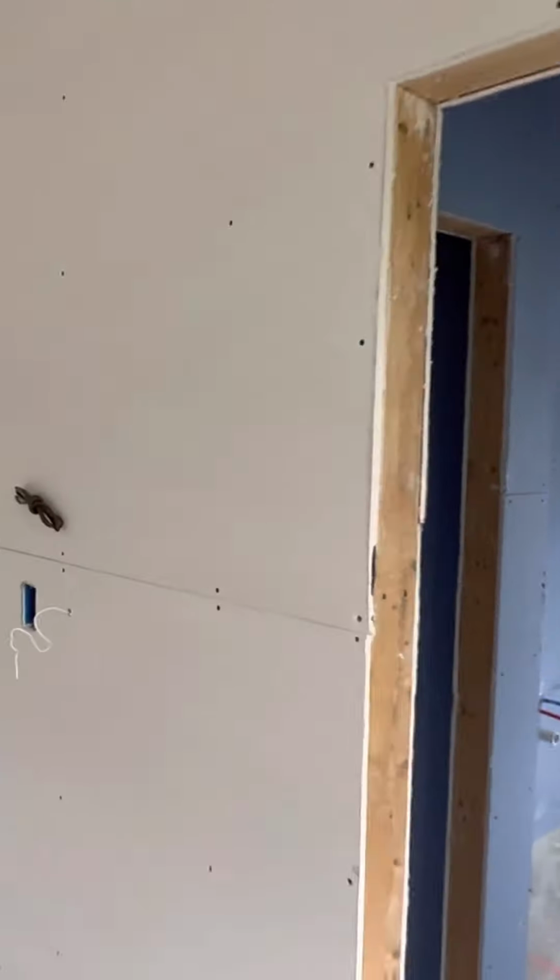I try to make the drywall square in the corners. You see there's some big gaps up there. There's still a gap I have to fill here, but I need a little bit of scaffold for this room. That was a big gap right there. The hangers used a router to put the flat together. You can see some breaks over here. There's a big break over here. There was another big break up there on that flat that I had to fill. Another one here. Now these are all pre-filled, so when I lay my tape on there with my Bazooka and I go across my angles with my glazer, everything's gonna come out flat and smooth. So that's the first step that I do before I run a tube.